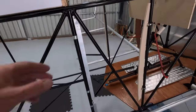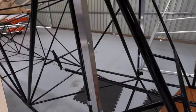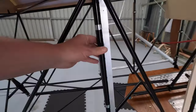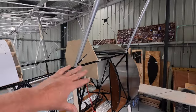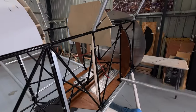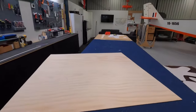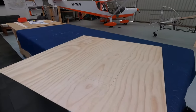I've got the L angle bolted on. I think what I'm going to do is just keep the metal where the bolts are and scallop all this out, just to sort of hide it. That's bolted on, giving me a frame at the rear post and the front. I'm going to cut some plywood now, Clico it on, and then we'll work out how we're going to do the bottom and whether I need this side kidney panel. Made my template - I've got a nice piece of three mil ply. I'll cut this out and Clico it on. If it works, it works.